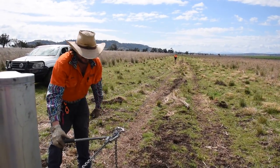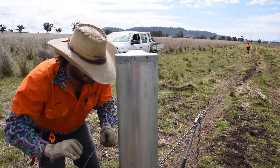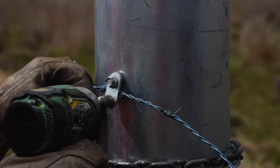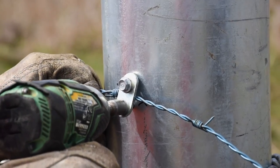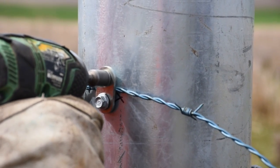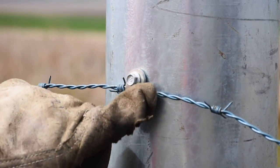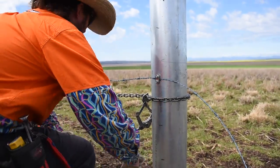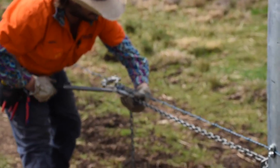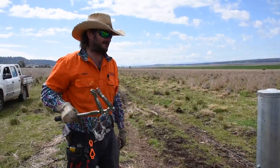That's at the bottom of the plunger and it's well and truly tight enough. We're going to attach our two-hole plate on now. So this is just a running post, and traditionally you tie a knot around the running post. The two-hole plates enable us to just keep running without tying any knots. We tighten enough that the plate bends but the tech screws don't break. And now we can undo our barb.